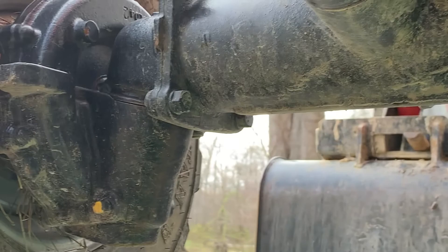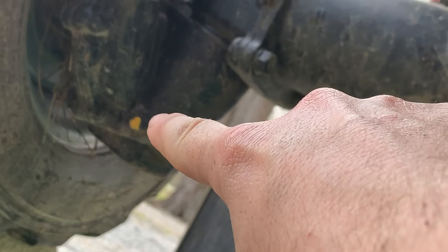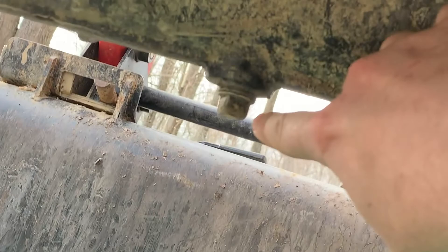Front end, front axle — oil needs to be changed, gear oil and all that. There are three points. As you can see, that yellow dot right there is one, this right side is two, and one in the middle right there — drain plug. Just square bolts, grab some channel locks, bust them loose. One at a time, do that, let it drain. It shouldn't take more than a couple minutes.